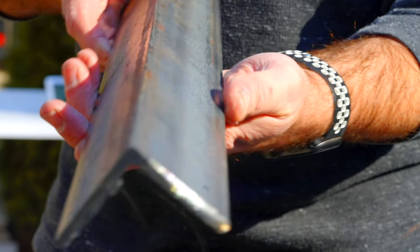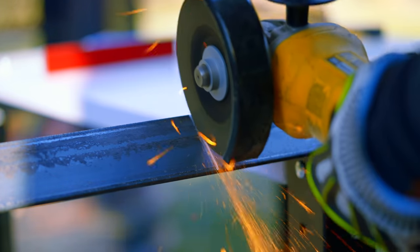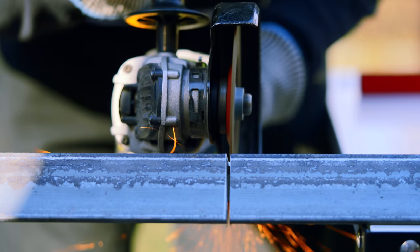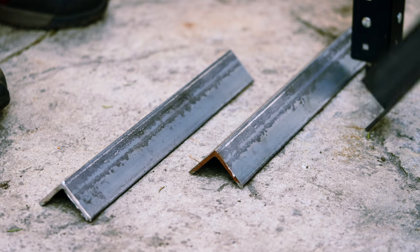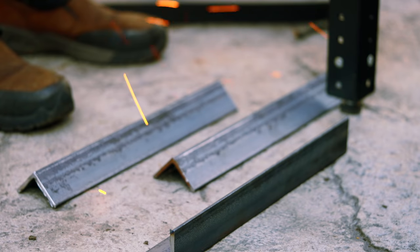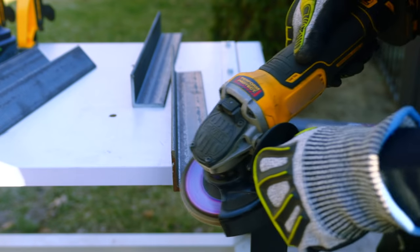This is two inches wide and three-sixteenths inches thick. I've got a cutoff wheel in my angle grinder and I've already marked my line on the angle iron. I like to score the line before cutting all the way through — it gives a place for the cutoff wheel to fall into. Now I've got a flat disc in my angle grinder, basically a bunch of layers of sandpaper, and I'm going to deburr and take off the sharp edges on the angle iron.